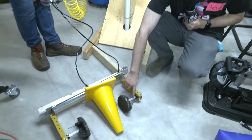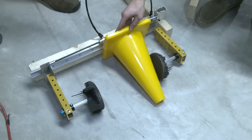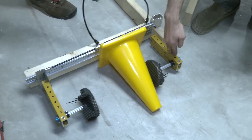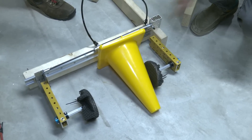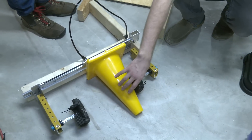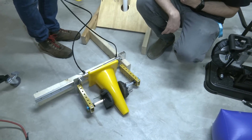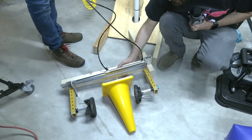One of the reasons we have these churros from AndyMark is that we need the base of the cone to be able to swing around. If we just had the 2x1 extrusions all the way over here, you'd interfere with the base of the cone and wouldn't be able to get it to rotate. Having these churros allows the rotation point to be in the center of the cone, so we can try that out — a little bit further back — and it rotates on over.